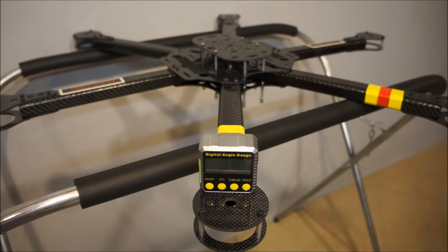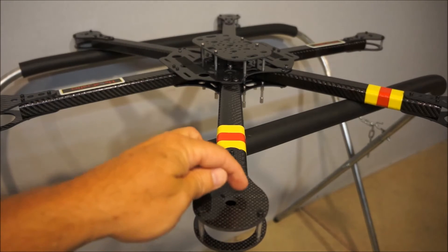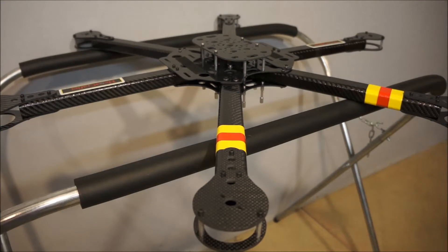What we need to do here is apply .2mm shims to the two right-hand bolt holes between the frame and the motor. In doing that, it will rotate the motor into perfect alignment with the frame and the IMU, and you will see significant improvement in your overall modal charts from your flight log data.